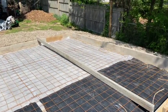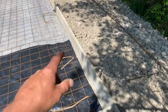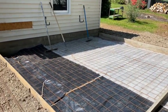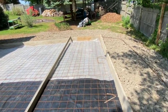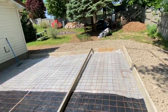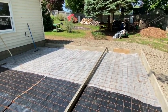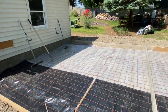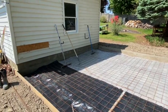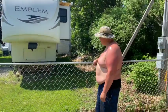Here's the pad - I'll be in the AC skid steer. So here's our little mono slab. We got rebar around the outside - two rebars around the outside - and we're actually going to throw two in the middle. We got wire mesh in here; we're going to be pulling that up with the potato rake for wire mesh placement. We can hit this from either side. It's a lot drier right now than it was last time we were here - it's been about a week. We're going to get this poured and we're going to try to lay some blocks on top of the pad today and get it done.